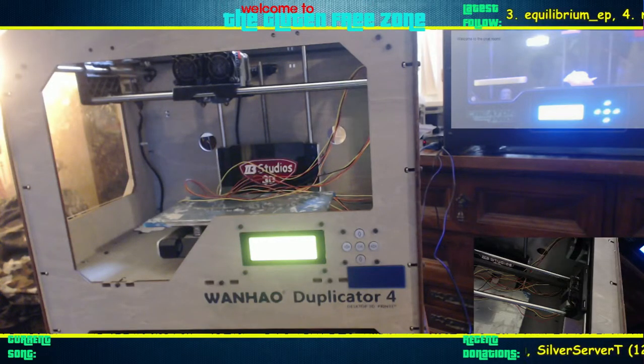Comm 3, connect. Okay, jog controls. What I'm going to do here in a second is jog it home. I'm going to pull the Y axis out some and move the X a little bit further opposite home, because those are the two. Then I'm going to actuate the home signal — we're going to home all. And then I'm going to show you that the X axis end stop is not working properly.